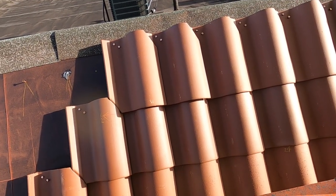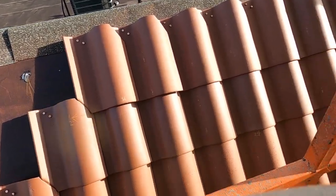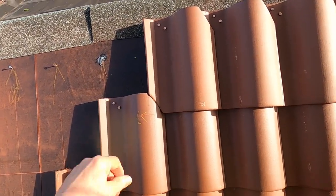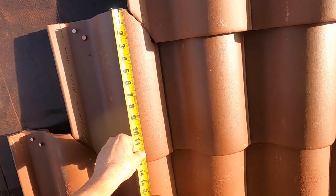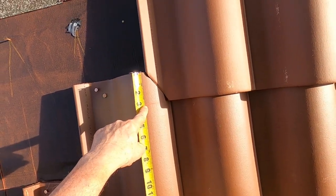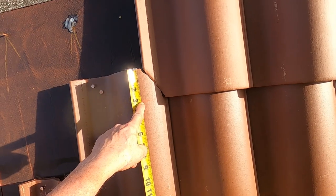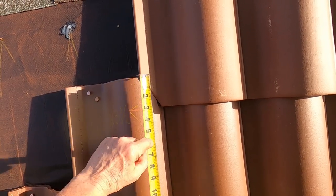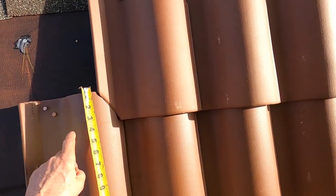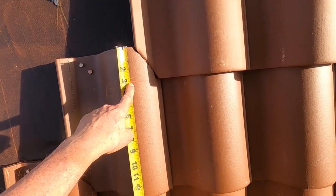And so that spread it out, and I'm thinking I have a lot more leeway with a Spanish tile roof than I do with say a French interlocking at the top and bottom. Well, what Ludowici has done is supplied us, me, with a quarter of an inch slack. It's 13 and a quarter, and they're requiring a 3-inch headlap. So if I want to maintain the 3-inch headlap, what I've been doing is chalking across on the face of the tile at the headlap mark. Now, I still have a quarter of an inch.